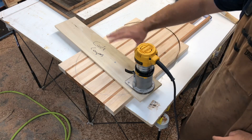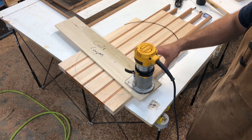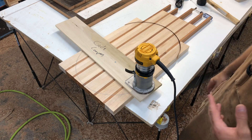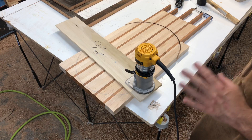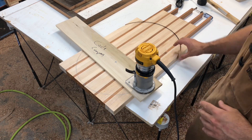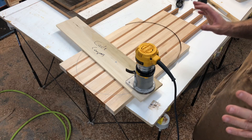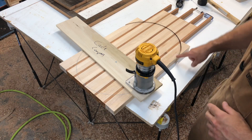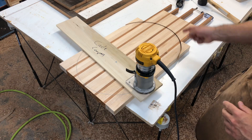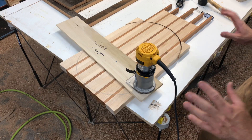I got the board turned around and the compass set up on this end. This is just a trim router with a really simple circle compass, and I leave this in the same position — I only use this for cutting out circles. I use a quarter-inch upcut spiral flute bit; that's what seems to work the best — it gets all the stuff cleared out of there the easiest. I'm going to go ahead and hog this out. If it's not dead nuts on, that's not a big deal — if it's off just a little bit, you can trim it on the table saw or do some sanding. I'm not going to go all the way through; I've got it three quarters of the way through. I'll go over to the band saw, trim that off, and then use a flush trim bit to get it the rest of the way — that's going to lessen my odds for tear out.